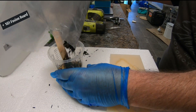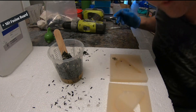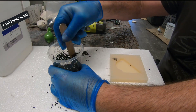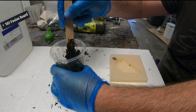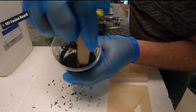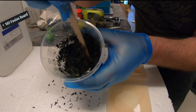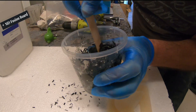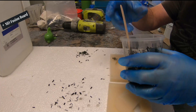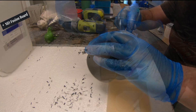We'll actually put it in here — real scientific pour. We'll mix this stuff around a little. Basically we're getting all the chop mixed up without disrupting too much of it. You want a little bit more than you need, because what we're now going to do is put it into the female part of the mold, just like that.